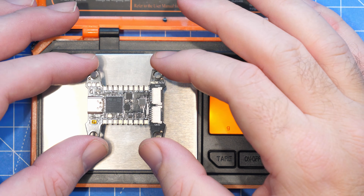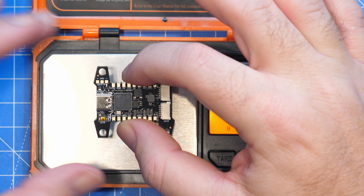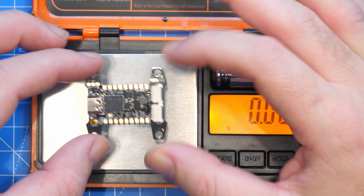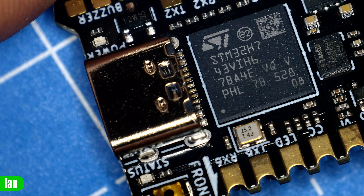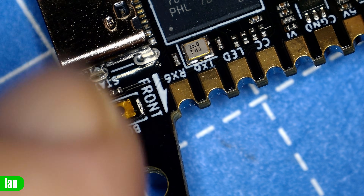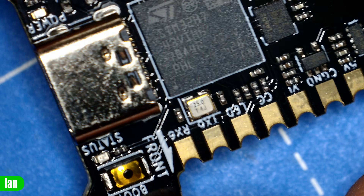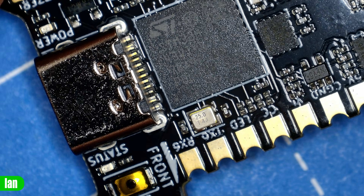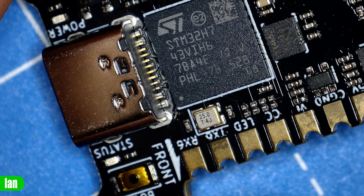When it comes to size and weight, it has a 30.5 by 30.5 mounting pattern, it is much narrower in the middle than lengthways, and it weighs in at just 5.47 grams. Looking under the microscope, first we have that nice new USB-C port, mounted on the top of the board with pins that go through the PCB and are soldered. That should offer real nice strength compared to the micro USB port before — micro USB has never been one of the greatest ports.